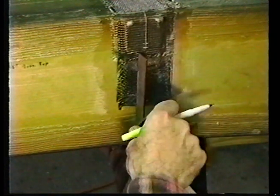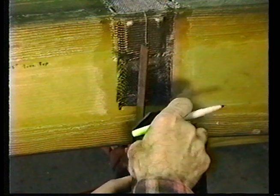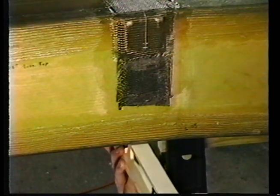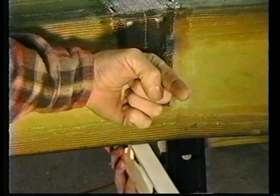So that comes right up to the mark. It's going to lock it in place. And I'm going to go to the forward face, transfer that line straight up to the height, and then I'm going to measure down from the end and give myself a crosshair. This will help me maintain perpendicularity as I go into the wing.